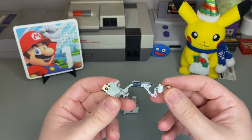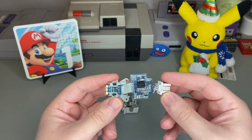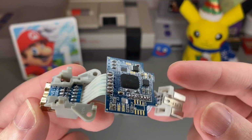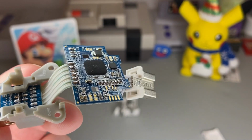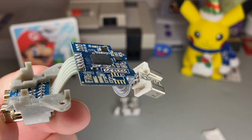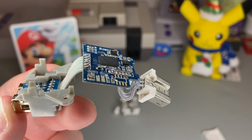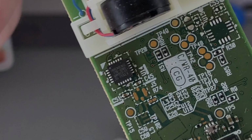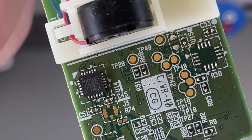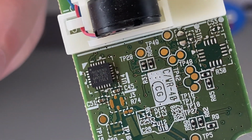The main chip that's used on a genuine Wii MotionPlus should be an InvenSense IDG600 on early models, and an InvenSense IDG650 on later models. These are both gyro sensors. Now, I can't show a real chip on a real Wii MotionPlus, but I do happen to have a Wii Remote Plus with a very similar chip on board. In this case, that's an InvenSense ITG3280.